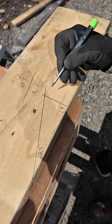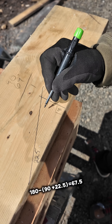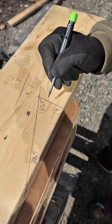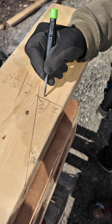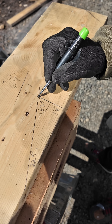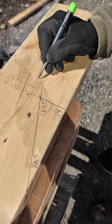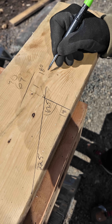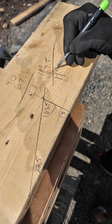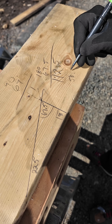All triangles consist of 180 degrees, and if we do the math here quickly, taking away 90, that works out to 67.5. Now that is not your angle because we're cutting outside the triangle here. So imagine we've got 180 degrees here and we are bisecting that angle, or cutting that angle in half. So we take 180, subtract 67.5, and that works out to 112.5. Divide that by 2 — 56.25 degrees.